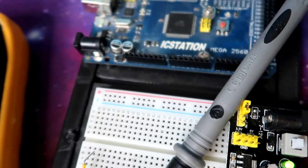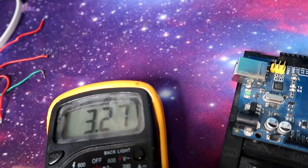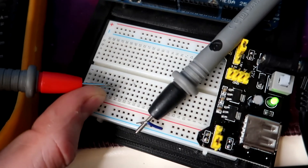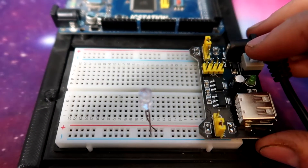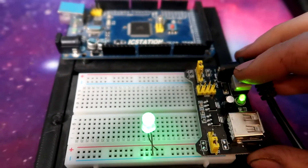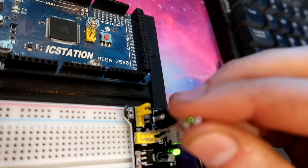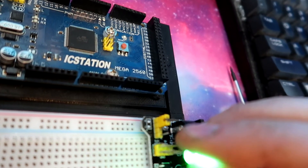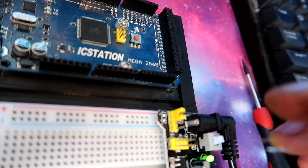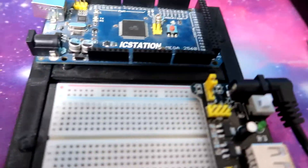Now we're going to look at the other side — the 3.3 volt rail. I do the same multimeter measurement and you can see 3.3 volts, which is what we were expecting. With the 3.3V I can plug an LED directly into it via the positive and negative and you can see it lights up fine. I can also put it across those available power pins — the 3.3 volt ones closest to the breadboard. If I put it on the 5V it would fry that LED, so you would obviously test something appropriate if you wanted 5 volts.